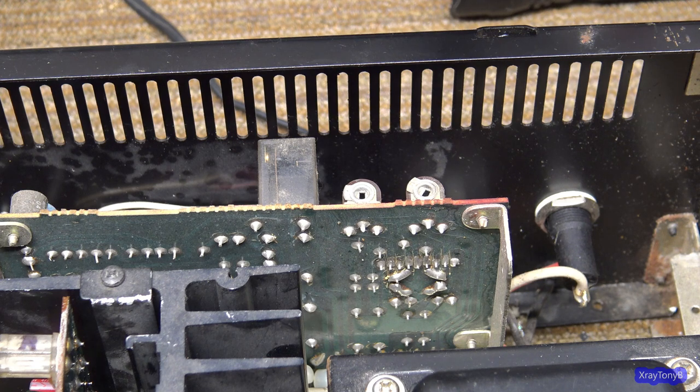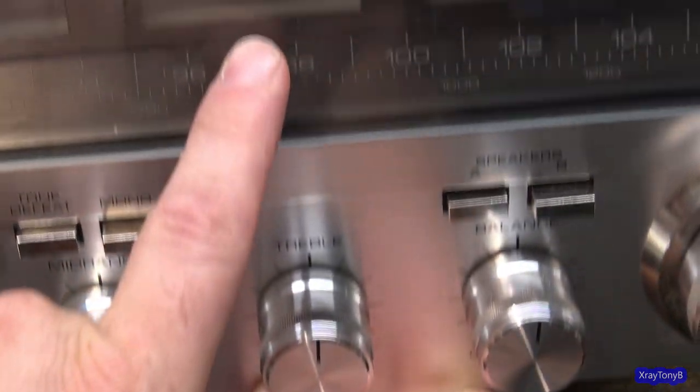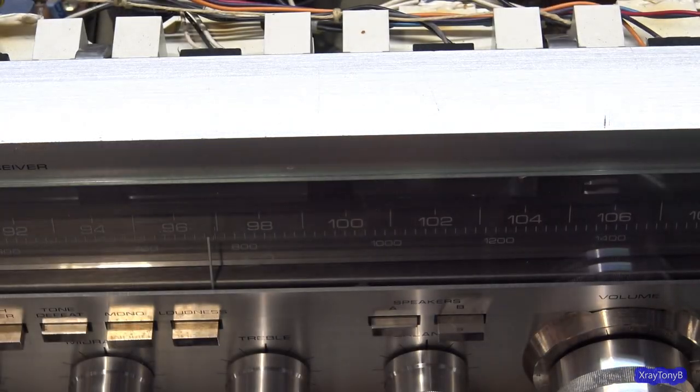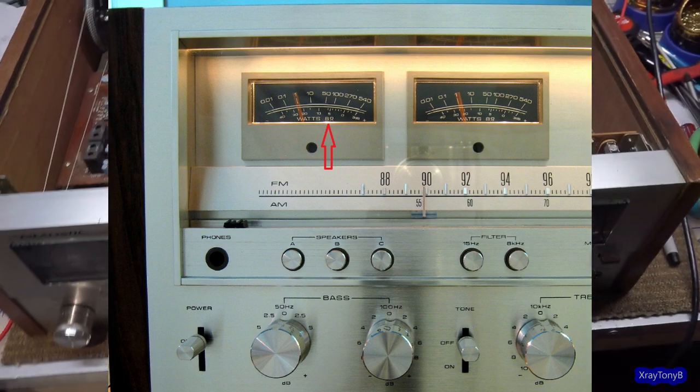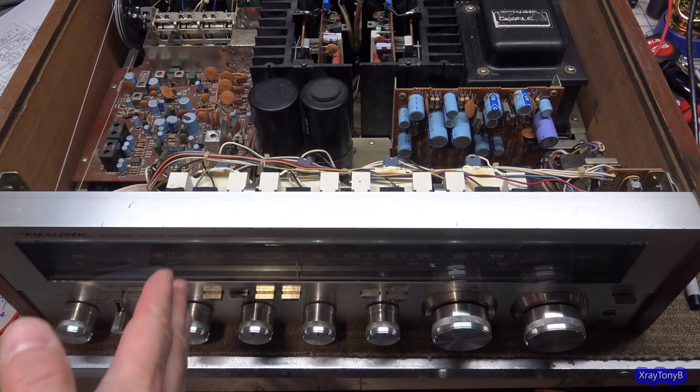All the meter is doing is measuring the voltage being applied across the load, in this case the speaker, and representing it on the scale of the meter as watts, because of Ohm's law. Most meters say watts 8 ohms, for instance. Some meters will have two scales, an 8 ohm scale and a 4 ohm scale, because as the speaker load impedance changes, the accuracy of the meter will change.